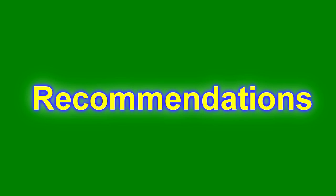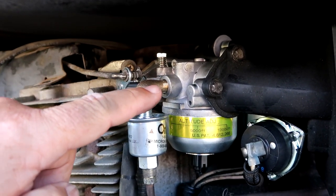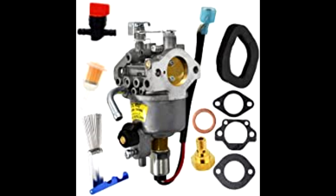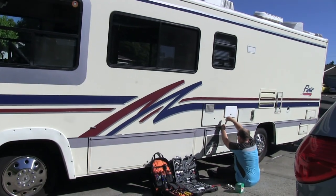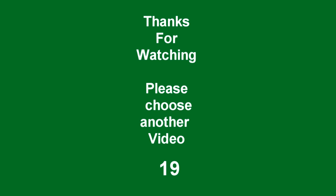For recommendations — what would we do different? The big thing is that elbow coming off of the carburetor. If you go onto Amazon and look under Onan generators, you'll find they're now putting a different elbow on that, hooking a gasoline hose directly to it, and instead of using an official Onan gas filter, they're using a plastic gas filter and running that line directly to the fuel pump. If we were going to do it again, that's definitely the change we would make. We hope you enjoyed the video — please give it a thumbs up and subscribe. Thank you.